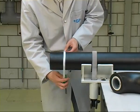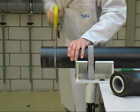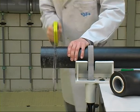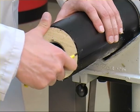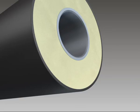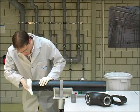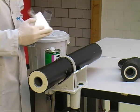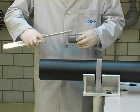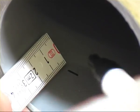CoolFit pipes and fittings up to D110 can be joined without calibration after being cut to length according to the Z measurement method. It is essential that cuts are done at right angles to the pipe axis. Deburr the PE jacket and ABS pipe after cutting and remove swarf. Chamfer the inside of the pipe to an angle of 45 degrees — the deburring tool is good for doing this. Clean the inside of the pipe as well as the double nipple with Tangit cleaner, using fresh white lint-free absorbent paper. Mark the joining length on the inside of the pipe with a pen to help apply the correct amount of solvent cement later.